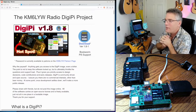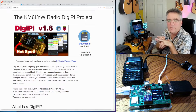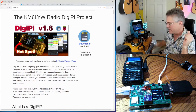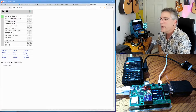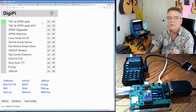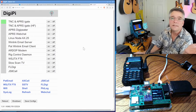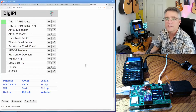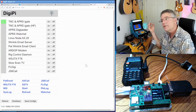This will probably be available in the next 30 days as of the beginning of February 2024. This is for dual-band radios. If you have a USB-based radio, all you need is a Raspberry Pi, USB cable, and this cool little screen. It's all web-based — all you need is a Wi-Fi device. If I go to DigiPi on my home network, I can get the whole management console. Right now it's in TNC and iGate mode. I tweaked it to be a tracker and read the GPS. In your position comment, you can run a command that reads the temperature sensor and GPS. It does all these other modes as well: JS8 Call, WSJTX, Slow Scan Television, all the packet modes, and it has a bulletin board. This DigiPi Hat is really going to make it easy for everyone to hook up a dual-band radio.